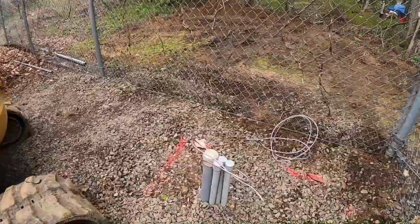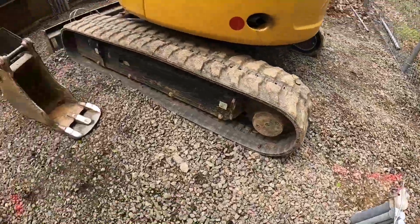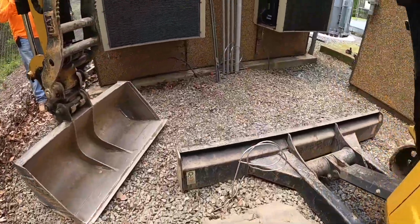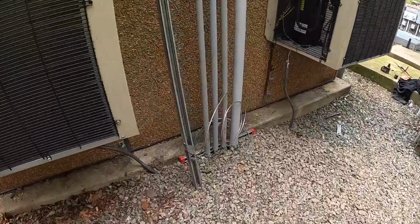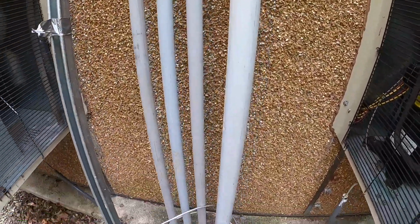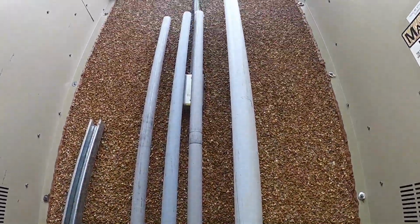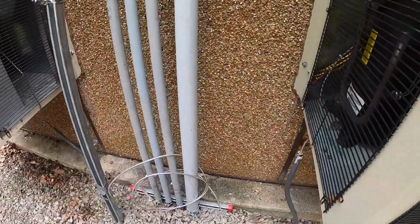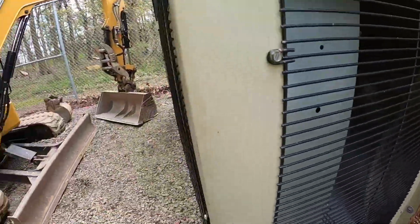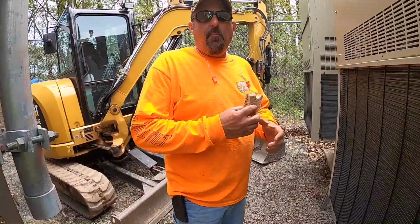We have our pipes stubbed up and capped off. Stone's already on grade. Got our other pipes going up the wall there. We've left them long. Got a ground there. We're gonna tie our rebar and build our forms in the dry shop tomorrow.